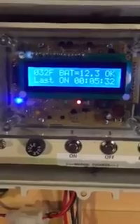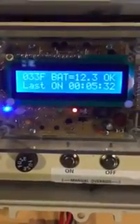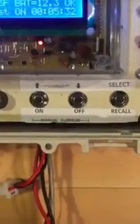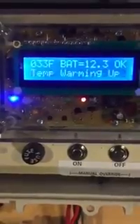The temperature probe is disconnected and instead I have a knob, and the knob is going to simulate the temperature that you would see in the sugar bush. Right now my turn-on temperature is at 34 degrees, and these are programmable. There's a row of buttons here — we'll talk about those later, but you can change any of the settings using those buttons right in your own backyard.